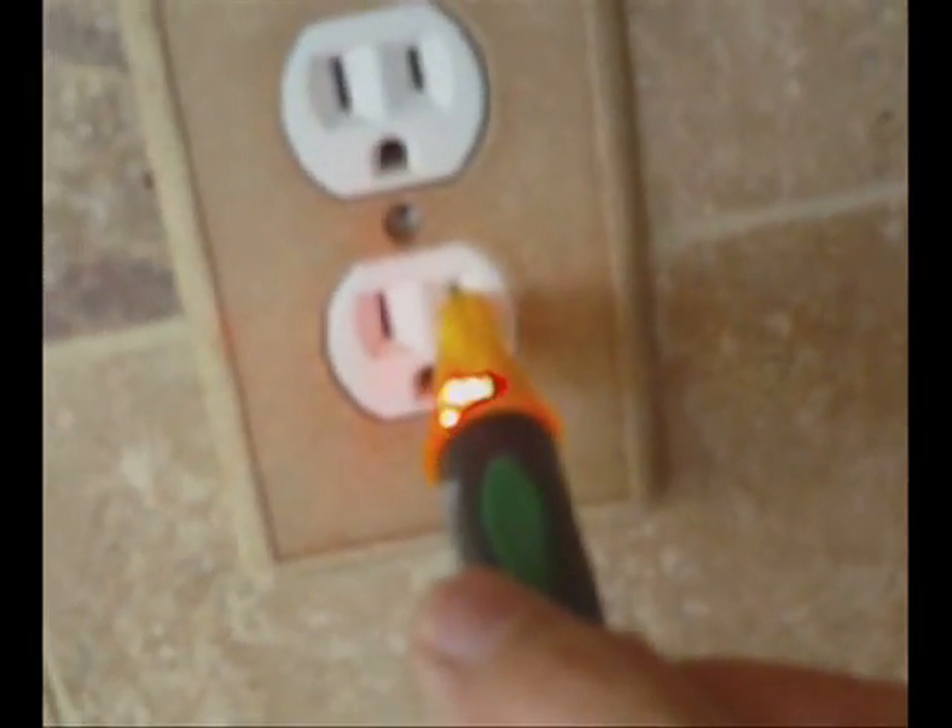This proves to me that this is working. If you can hear it, it's tweeting, the little red light's on, and you hear the sound — that tells me it's working. Now I go up to the wires themselves and I test the wires. If there was power in it, any power at all, my sniffer would find the current and sound off. It's dead — there's nothing. This is working, and just to prove it again, there's my circuit. This is dead. This is safe.